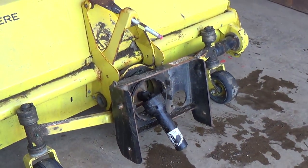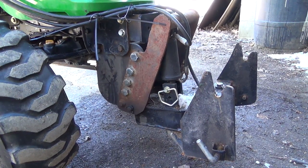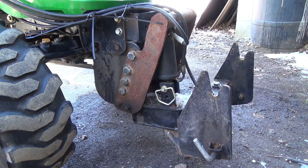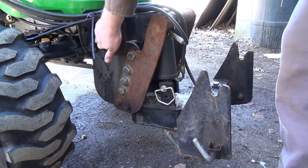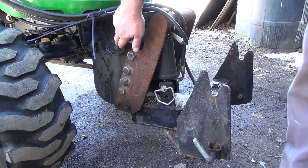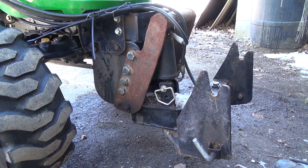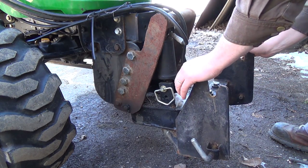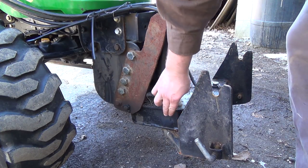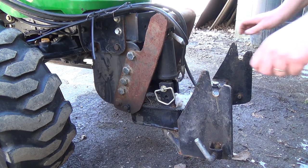And whoa, let's start tearing that back plate off here. And this is another bunch of stuff I got to look at again. Man, this quick attach system is awesome when it's new, but when it wears in a bit, oh, it sucks. Back in here, the plates get wore. This pinhole here is wore. So you don't get the push down, which is fine because I generally just float my stuff anyways. Push the stick right forward, it just goes into float position. But turning this way, it's gotten loose again in this back pin. So hopefully it's not this bracket here again that we just replaced. I got that whole entire kit just to replace that one because it was cheaper. Remember that last year. Hopefully it's just the pin.